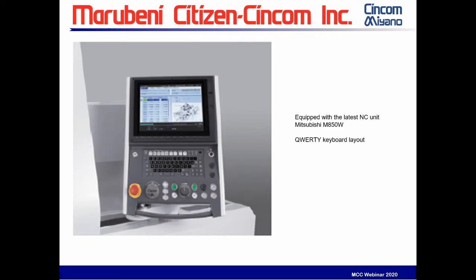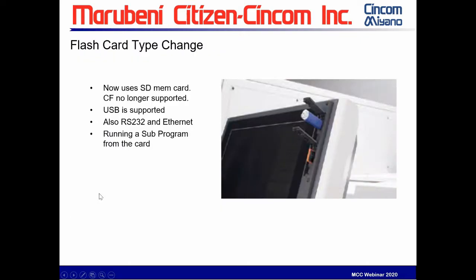It's got the latest Mitsubishi unit. The screen is 15 inches. It's a touch screen design. With the QWERTY keyboard, data input can be a lot easier. Input and outputting programs have changed a little bit. You now use an SD memory card. Compact flash cards are no longer used. You can use a USB card, a stick. Also the standard RS-232 and Ethernet is capable. And as with our other machines, you can run a sub program from the SD card.